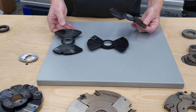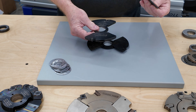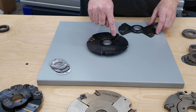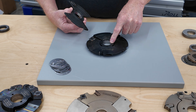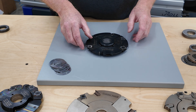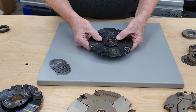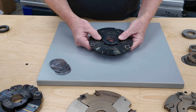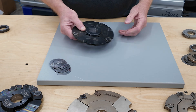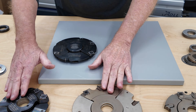You have to apply your mind when setting this up, because when shooting for a particular width you need to balance the shims on both sides to get that width evenly. This cutter head came with very short stubby roll pins — they were a nuisance from a setup standpoint, so I eventually pulled them out. They came out easily. And if you buy a new Amana now, a friend of mine purchased one within the last year and his did not even have pins.